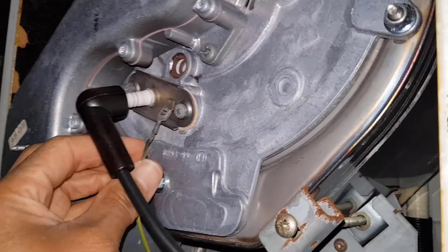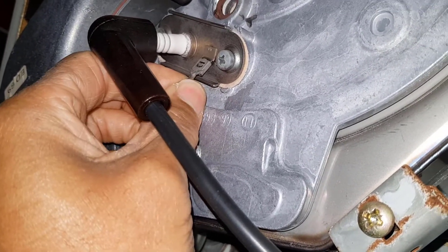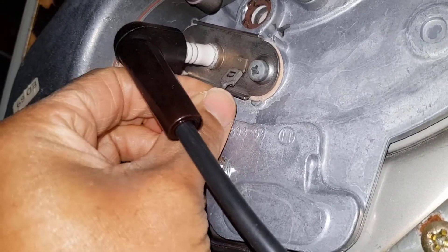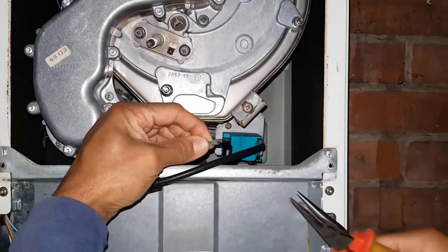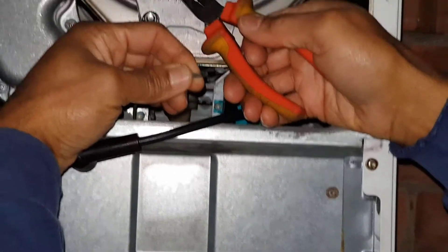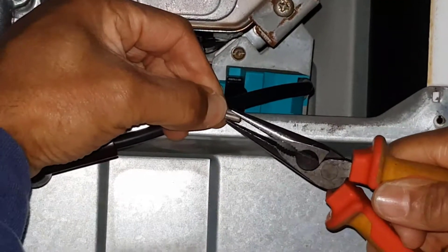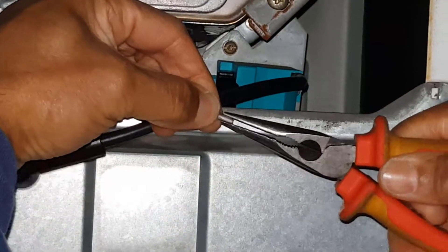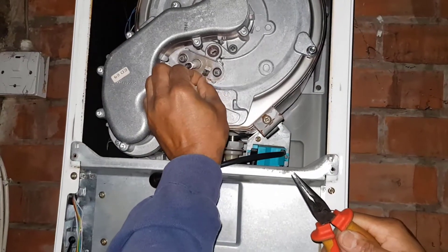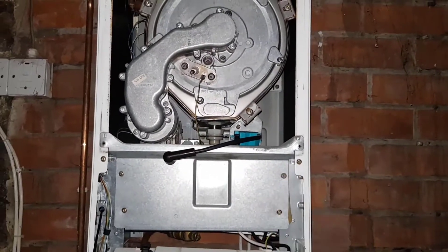Looking at this earth clamp, you can see it's loose there. So what I'm going to do is pull it off and make it more secure so it's not moving like that. I'm just going to gently squeeze this just a tiny bit so it's going to be tighter on here — just press it a little bit. That feels better, yeah, that's better. We'll give that a go, put the lead back on, and try it to see if that makes any improvement.